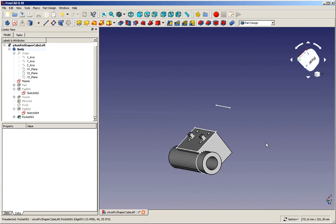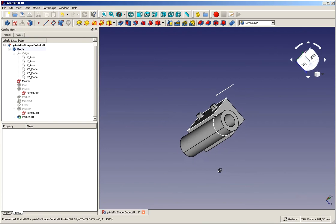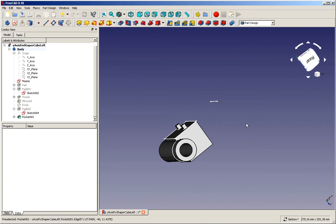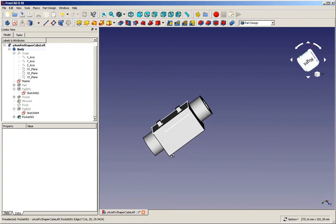Now there's one thing left over in this little design before I make a test print, and that would be a possibility to lock my two bearings, which are going to be inserted from either side, to lock these bearings somehow in position. And I want to use a hole and a screw for the locking. That is good enough for what I need.